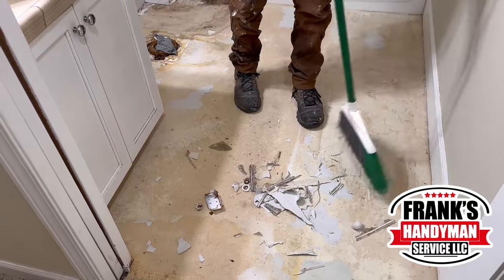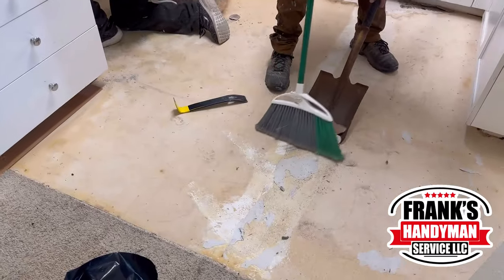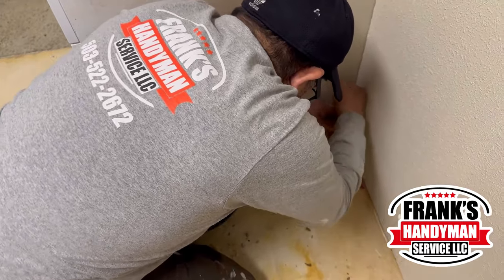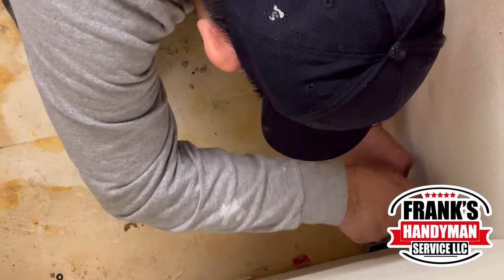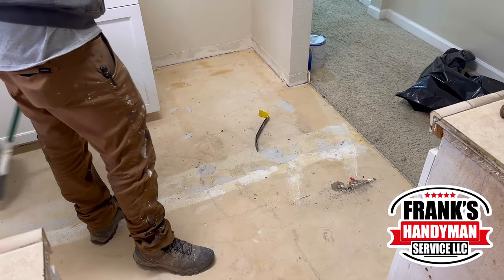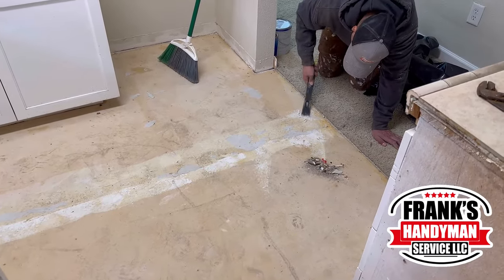As you can see, once we took the vinyl flooring off, you're going to take all the small debris out of there. When we put the new material on, we're also going to apply a certain type of glue, and you have to make sure there is no debris on the surface. That's one of the most tedious parts — you have to ensure the floor is completely clear. There can't be any debris or bumps, because once you put the vinyl flooring down you're going to feel them. They have to be really detailed, scraping off everything and brooming off all the debris.